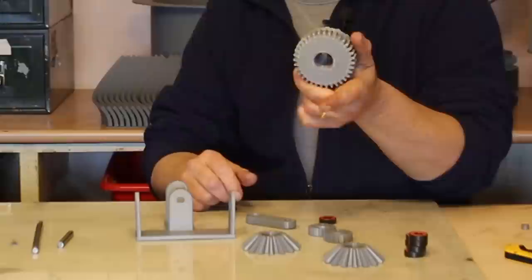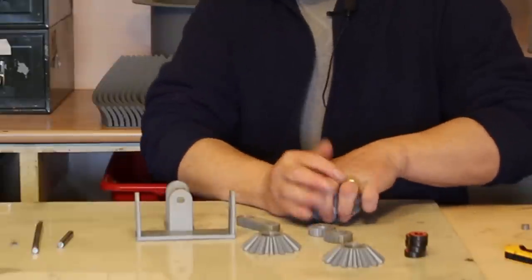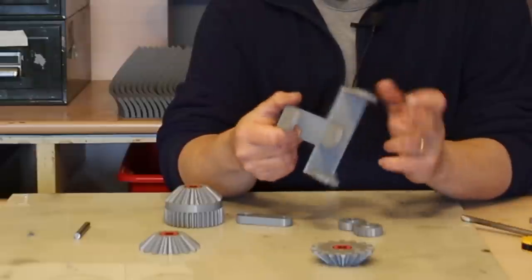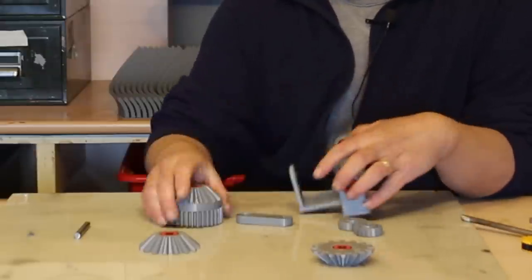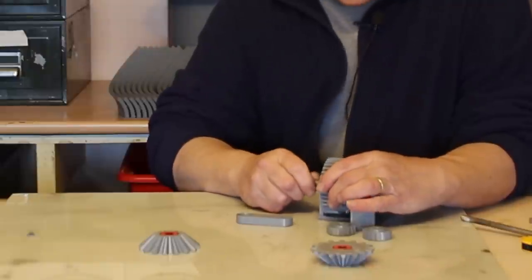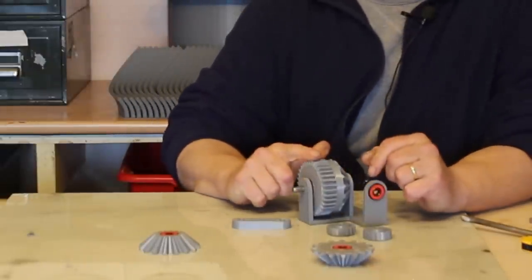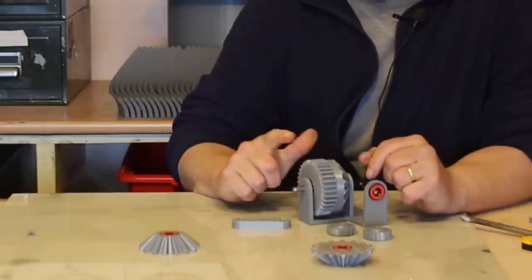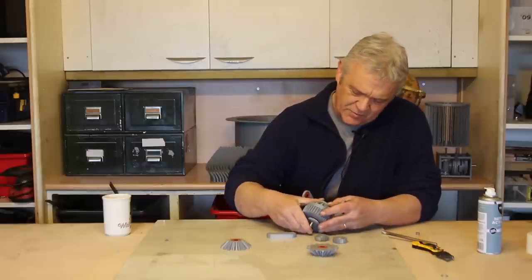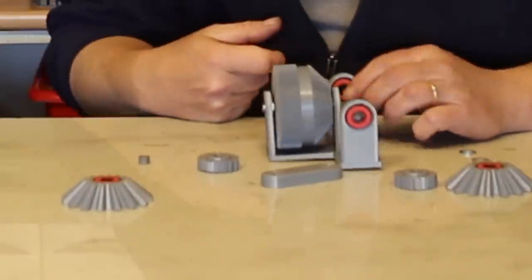To make this thing, the first step is that bit needs a couple of bearings in it at either end, so we put those in. The same is true of these bits. In the frame we put a couple of bearings in there, and that bit takes this one facing that way. It has a 100mm bit of bar to go in there, and that has a gear on it so we can take some output, since this is the one that will turn in the same direction every time. We connect a generator to that and we have exactly what we want, so put the bar in there and that goes in there like that.